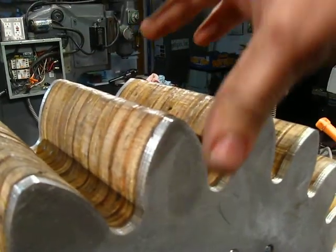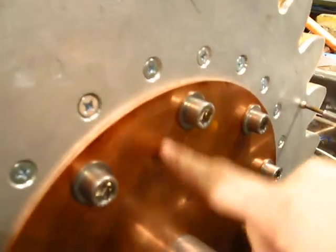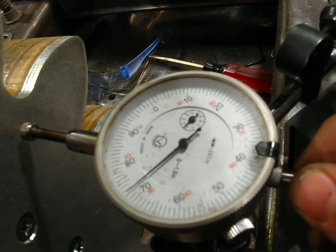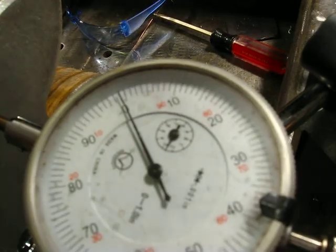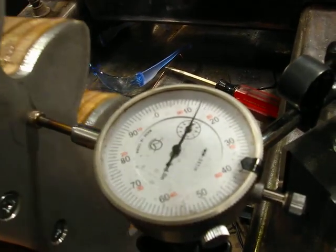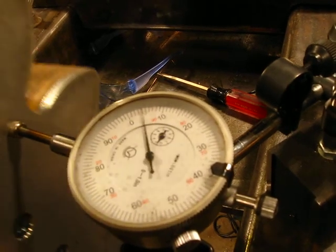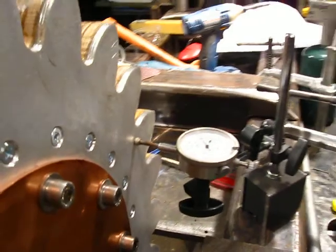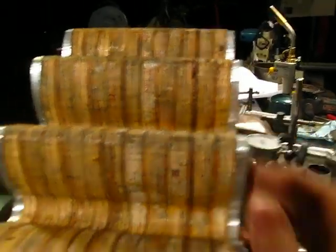This piece of aluminum used to be a ramp sitting on a concrete floor, so it's been driven over multiple times. With plywood and a steel plate on the inside, I was a little leery about what type of accuracy I'd be able to get. I have a dial indicator pressed up against the wheel, set at the low spot reading zero. Each increment is a thousandths of an inch, and spinning the wheel it jumps up to about 21, maybe 22 thousandths of an inch and back to zero. That's about the thickness of six sheets of paper, so it's fairly true — truer than I was hoping to get with the aluminum and all this plywood in between. Very happy with that.